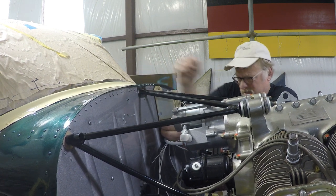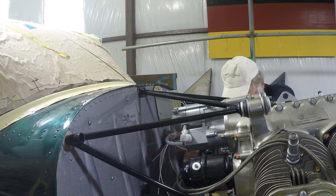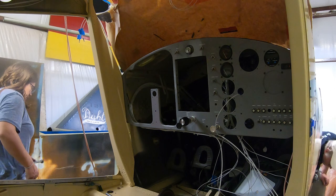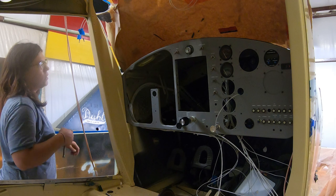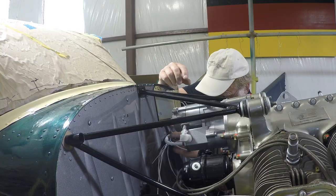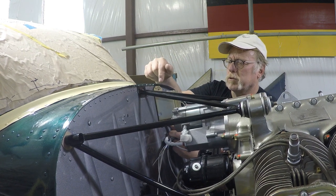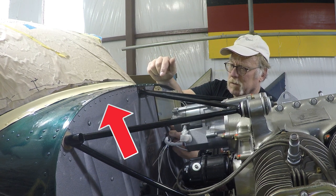Oh. Okay, taking that out. Now I think, yep, we put a spacer, two washers as a spacer, because of the corrugation on the firewall. Keep it pretty. Yep. Boom, boom. Okay, your bottom left. Yep. Alrighty. Do it. And also, the other reason we put the spacers on is up at the top end, there's a row of rivets.